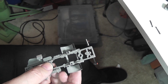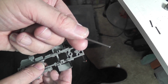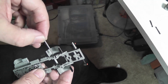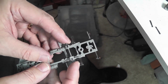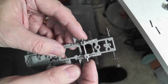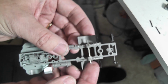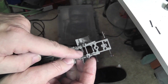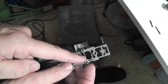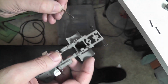The original axles were rather strange 1.7mm diameter, so I thought I'd put 2mm diameter in to replace it. And interestingly, that 2mm diameter new axle just slides in and is a lovely easy fit in there. Haven't had to bore it out at all, so that's great. That will be the new axle. Gears, a shortened gear will go on there because I've not got too much room, and then the rear wheels will go on there, and that'll be the drive done. So that's ever so easy.